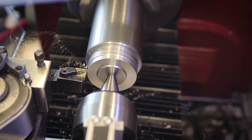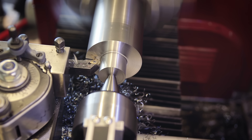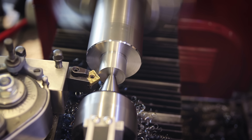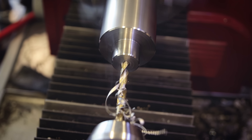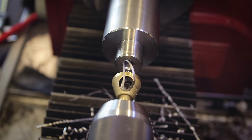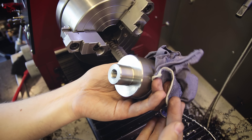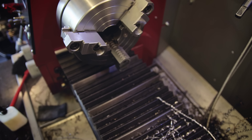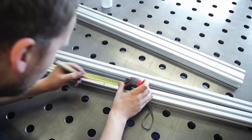On the other side I'm creating a stud that fits exactly into one of the holes on my welding table, though this general principle would work with other tables as well. This is the only part that gets attached this way, so technically your table would only need one hole to locate it. The most important thing is that the table is flat. This side also gets a thread so the post can be screwed against the table from the bottom, ensuring it sits absolutely flush with the surface and doesn't move.